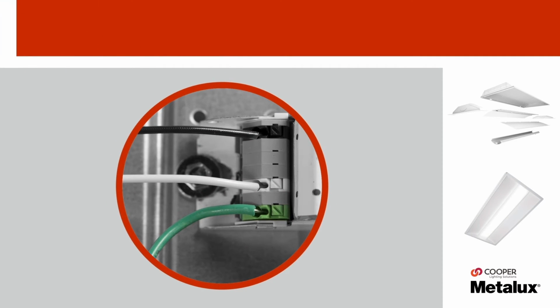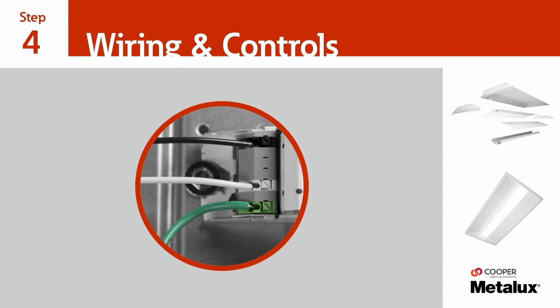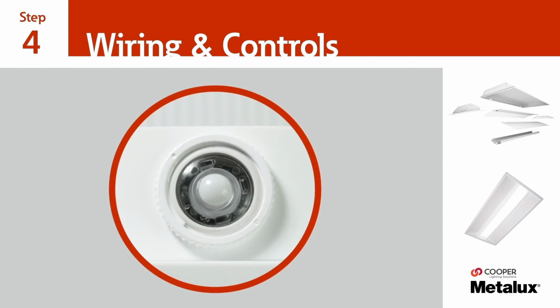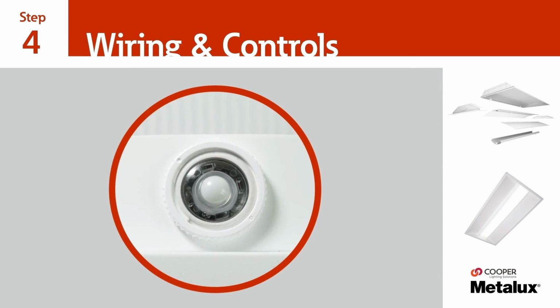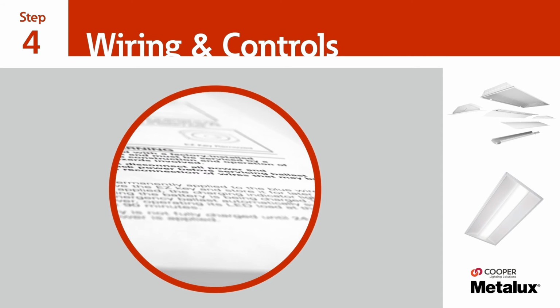Next, attach the ground wire from the main panel to the existing fixture housing. Then, connect the quick disconnect to the main supply wire. If your Cruze LED Retrofit Kit also includes sensor and/or emergency options, please refer to the installation instructions for additional steps needed to install those components.